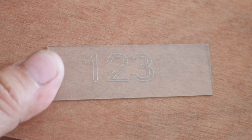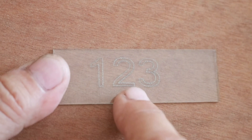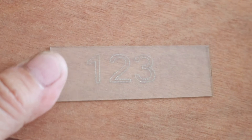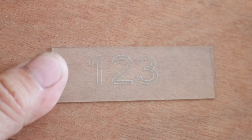So this is the result. I like it — even though it is only the outline of the numbers. Of course you can fill it for a better effect. This was done at 3.5 millimeters per second and 90% laser power.